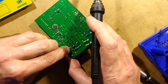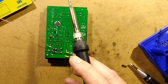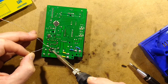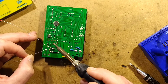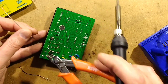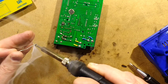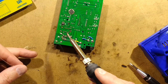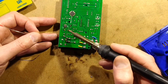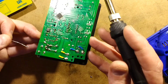This shouldn't take too long. This is probably the negative rail on the logic side - yes it is. The thermocouple will be generating a very small voltage between these connections, which then gets buffered up through some circuitry and what I'm guessing is an op-amp here - an operational amplifier or comparator, very similar functionality. Basically you set a voltage in one pin and it amplifies the signal, or you can set a voltage in one pin and when the other pin reaches that voltage, it changes logic state.